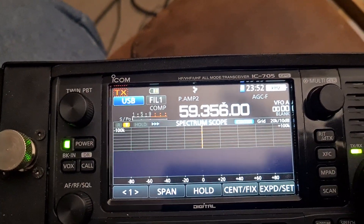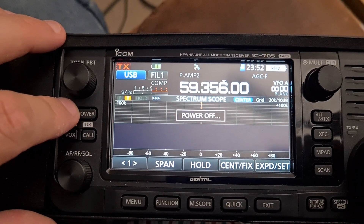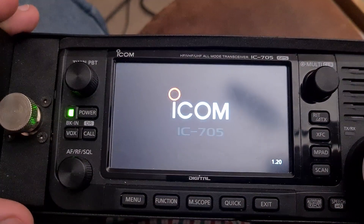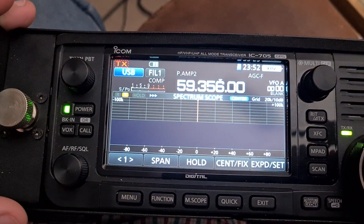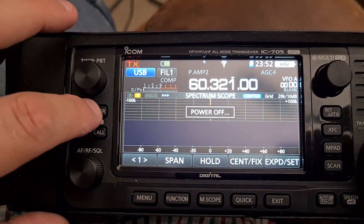Dropping it down below about 70-odd MHz, it then drops to the 6m band. I suspect this is probably the low-pass and bandpass filters it's using for each band. But I was quite surprised to note that the firmware had a 70MHz band at all. You'll see it now says 50MHz, so the cut-off frequency is obviously around 60MHz.